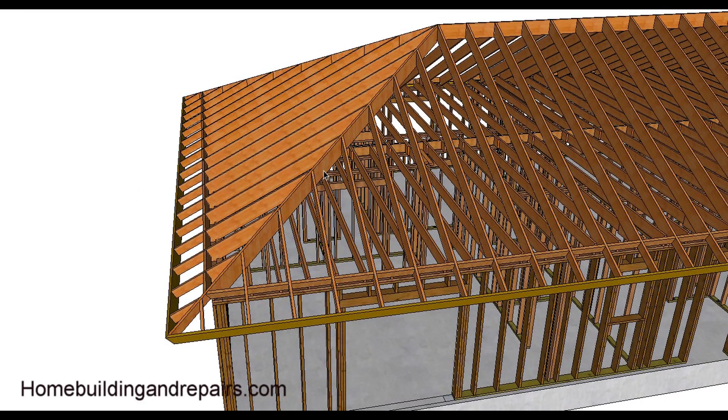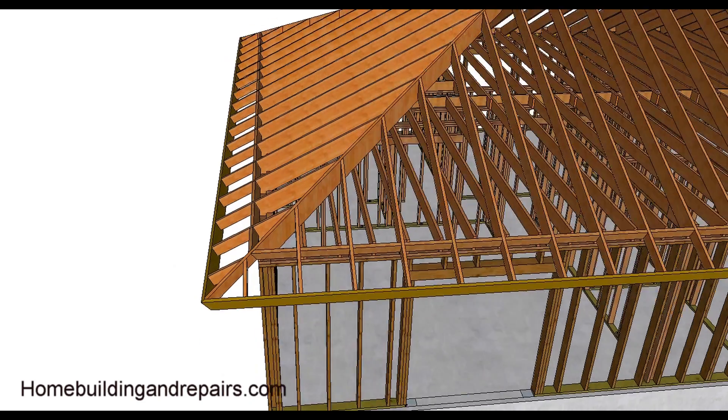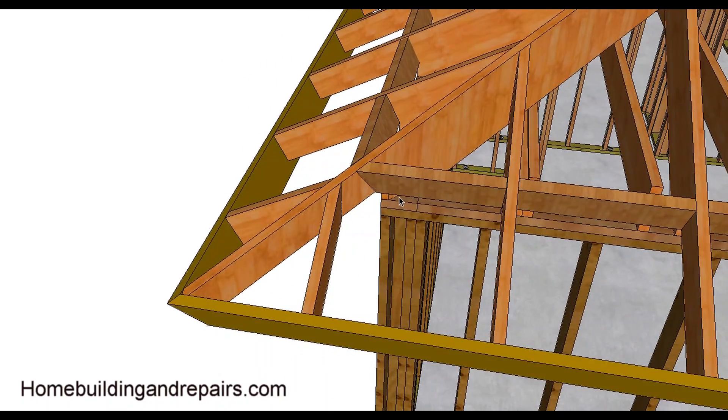The hip is usually going to be a larger board. If you have two-by-ten rafters, you might have a two-by-twelve or even a six-by-fourteen. I remember one job we did — it had about a 32-foot glue lam. It was a large, large hip. I didn't like the way the bottom connected on that job, but that's another story.